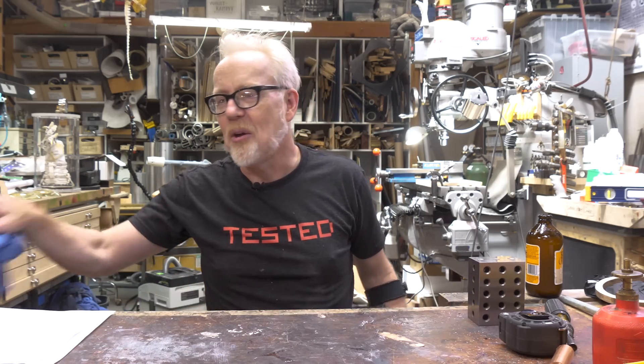Electricity in the shop — I want to caution you to be careful. When I think of some of the things I did in my youth in terms of power distribution in the shop, I'm a little bit shame-faced. I made the same mistakes we all do: I used wiring gauges that were too small. From a power distribution standpoint, extension cords should mostly be banned. If you wanted a rule of thumb, use the fattest wires for the biggest tools.